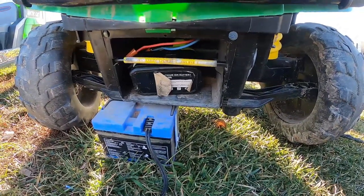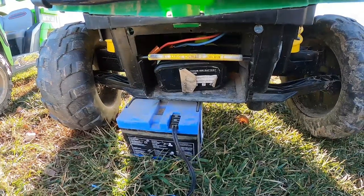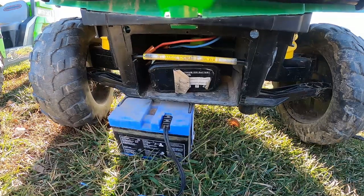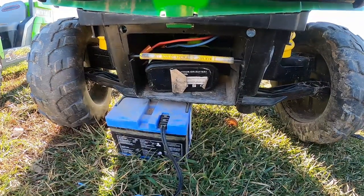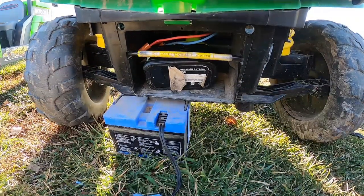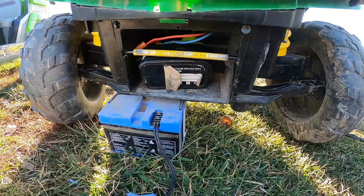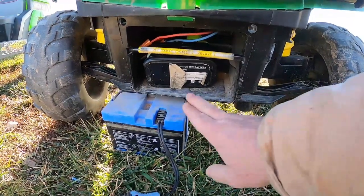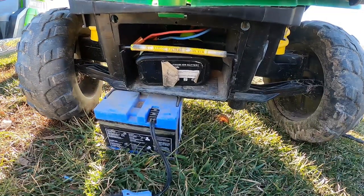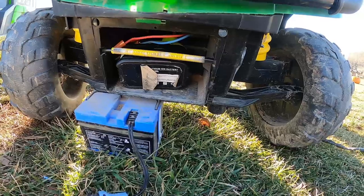One more thing I forgot — getting the battery back in. I'm assuming this probably had some kind of a cover that was lost at some point. I just put the battery on its side, pushed the wires in making sure they were good, and slid the pin back in. I'll stick some tape on there and it should be good to go. I'll probably keep a little thing of electrical tape in here, because every time we have to change batteries we're going to have to pop this pin out — which will be a little bit of a pain, but not too bad. The nice thing with doing this is these will run for hours on a drill battery, where with a regular battery like this you get about 20 minutes and then that's it, and it takes forever to charge. These batteries — I've got five or six of them — charge in about 20 minutes to a full charge.